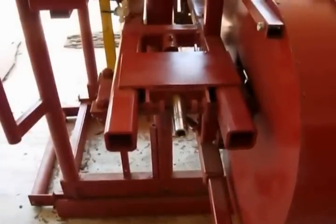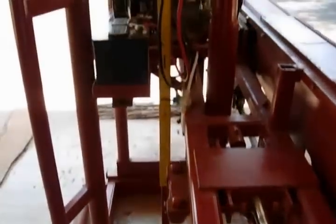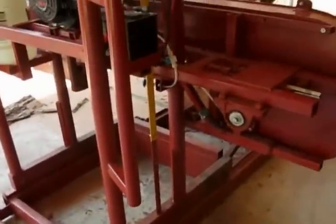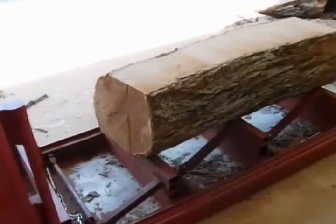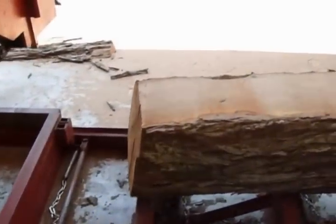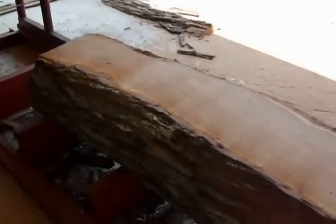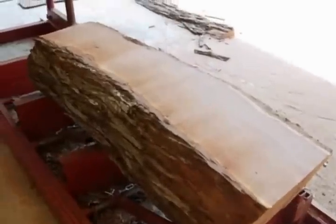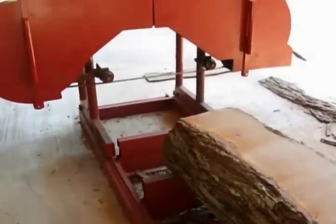The only adjustments I have are just toe in and toe out. In general, it's just a simple push. The easiest approach is to not fight the saw — let the saw cut the wood. If you do, you'll come up with a real smooth cut that doesn't take much planing to be finished. So, let's go cut a couple logs.